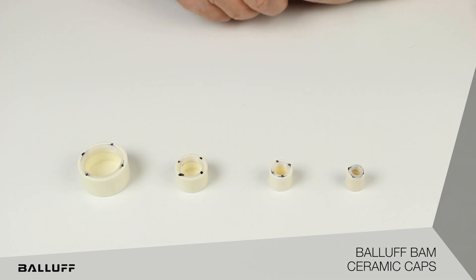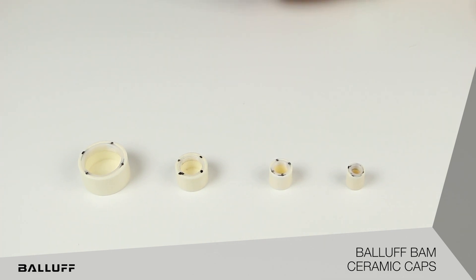We have to talk about some basic premises. Inductive proximity switches were invented a long time ago — the 50s and 60s — to replace contact switches: things that have plungers and lever arms and that sort of thing. Anything mechanical has a limited life. So these inductive proximity switches started being manufactured as a non-contact device, eliminating all that mechanical motion. They were invented mainly to see mild steel as the target to stop, start, control, and position some automated process.